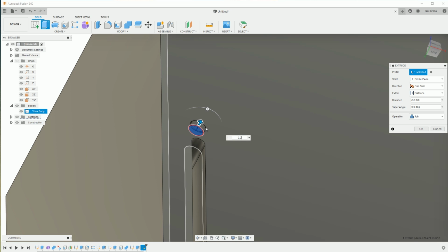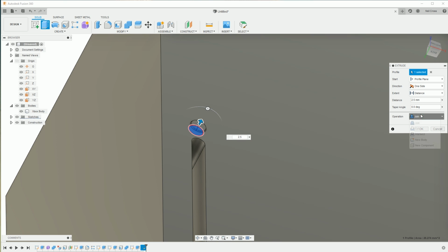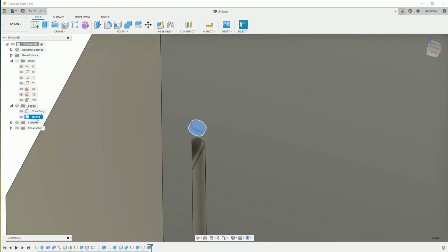Finish that sketch, and then extrude this button up out like this by 2.2. Yeah, so it's just sort of, no, a bit further. 2.5. There you are. So it's just sort of poking out a little bit. You can make this a new body if you want the button to be a new body. You would do that if you want the button to be a different texture to the case, but sure, okay. We'll make this the eject button, because you never know.